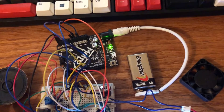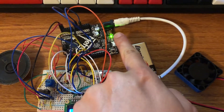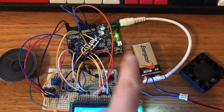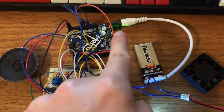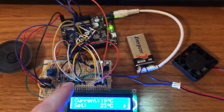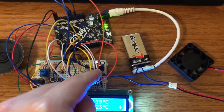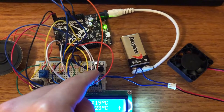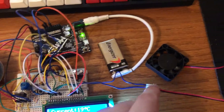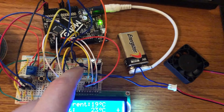You can also see that we are powering the Metro with a 9-volt battery into the barrel jack connector. If you are using the Metro or another board that has an on-off switch for the barrel jack connector, make sure it's in the on position. The 9-volt from the battery powers both the 5-volt regulator on the Arduino that powers all of our logic circuitry and the microcontroller itself. It also feeds into our linear regulator, which takes an input of 9 volts and outputs a separate 5-volt rail, which is used to connect to our fan.